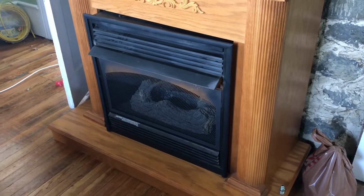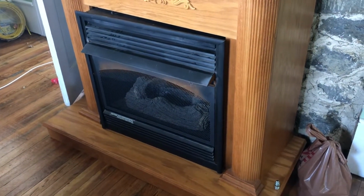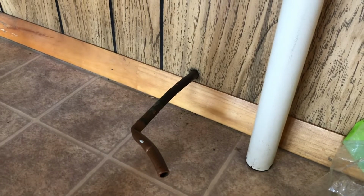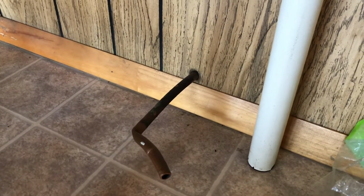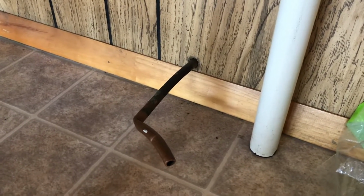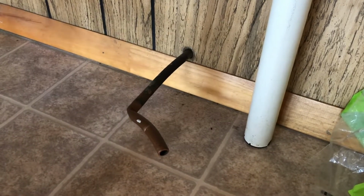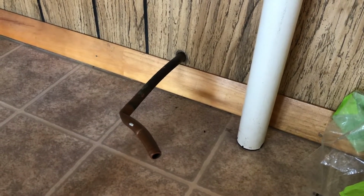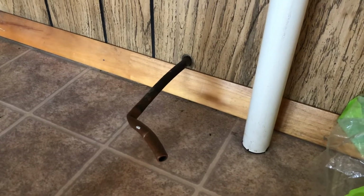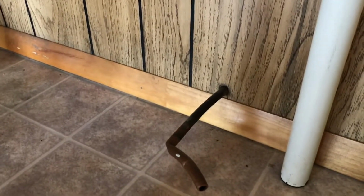And that's fine and all. We found where it comes out over in front of the house, but problem is there's also this piece of tubing sticking out of the interior wall of the kitchen where that heater was when we first moved in that we took out. So we are assuming that it's probably hooked into that other line over there, and you know, since it's just cut off on this end, we would either have to cap it here, or preferably if it is hooked up over there, hopefully we can just unhook it and cap it over there so we don't have this line over here that's not doing anything and creating a potential for problems.